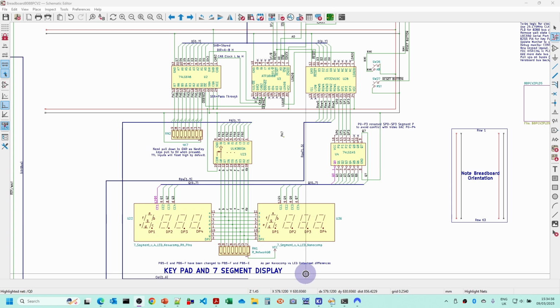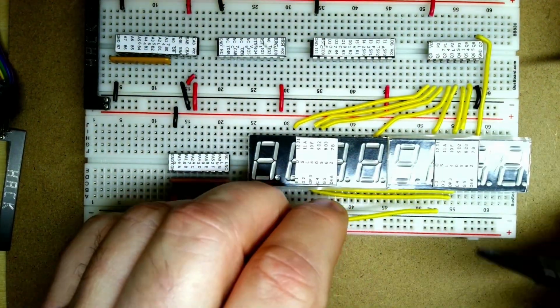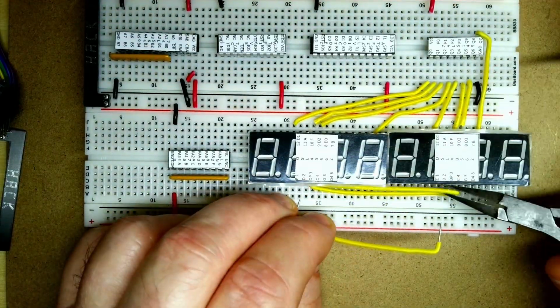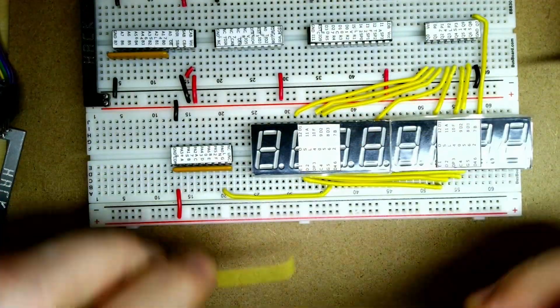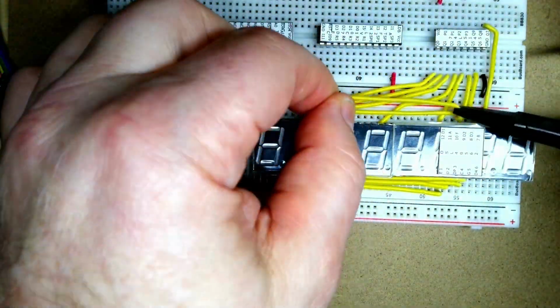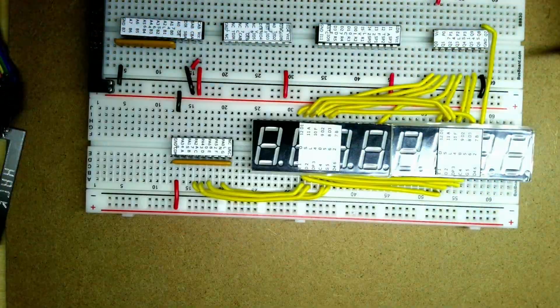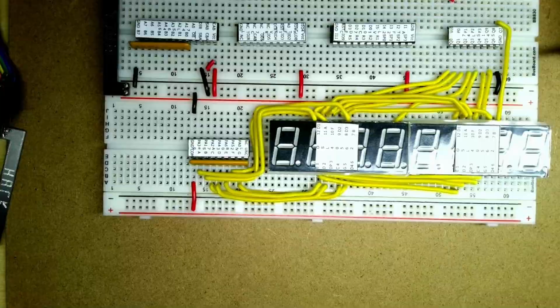Now we're going to look at all of the 7-segment values, so the A, B, C, D, E, F, G, and the decimal point, and the corresponding outputs of the Darlington driver there. And I think I noticed that I'd already made a mistake there. Perhaps I should put the labels on the side of the LED displays, probably easier. So we're just wiring in all of the lower side there, and then the upper side. Some of those holes on the left hand side there were incorrect, needed to move them along a bit later, and just wiring that into the rest of the Darlington driver.